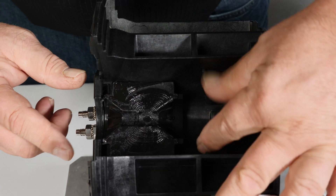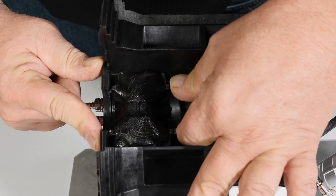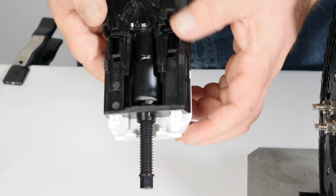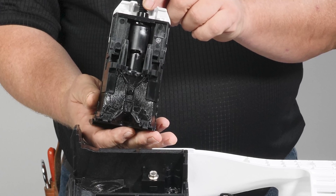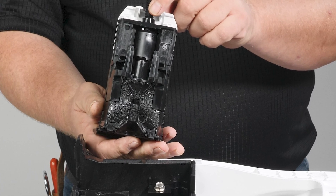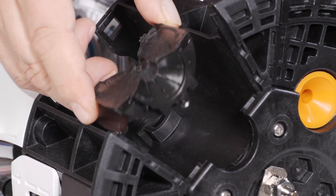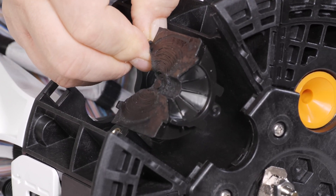Manually depress both sides of the base gel. Each time a sealing wedge is removed, manually ensure the gel compression screw is in the fully relaxed open position and extend the wedge sealing gel as shown. Set aside the sealing wedge in a clean, safe location. If the gel block is exposed to dirt or debris, simply rinse the gel with cold water to remove the contaminant. If the base gel has been released from the base, simply replace it in the proper orientation with the locking tabs engaged in the bottom of the base as shown.